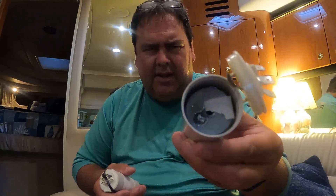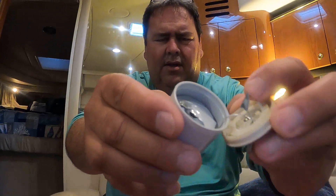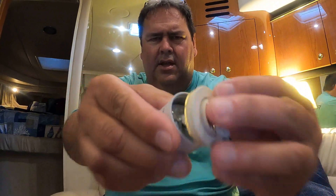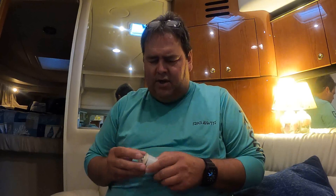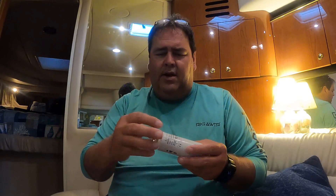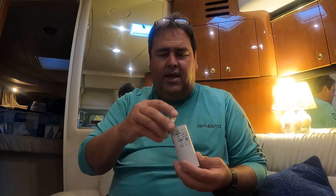So I took the capacitor and wanted to show you what I was doing. I took a zip tie — remember, on the old capacitor the top came off. If you look down in there, you can see the lead ripped away from the actual capacitor inside. I don't know what caused that — it could have been pressure built up inside and pushed it out. When I took it out, the wiring harness was pulling pretty hard on it. This was zip-tied into a bracket, and vibration of the generator when running maybe was pulling the capacitor. Maybe heat had melted the glue around it and this pulled out.